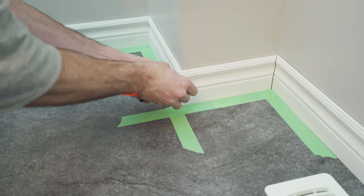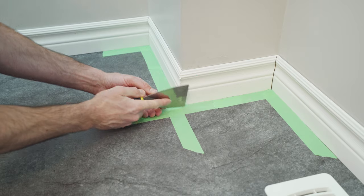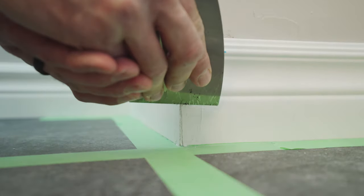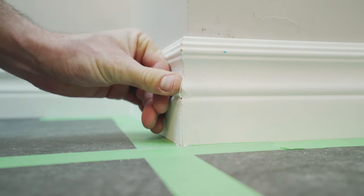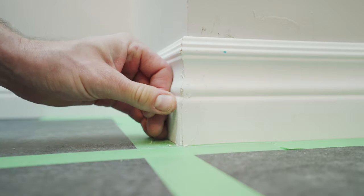As you apply the wood filler, always start at the bottom and work your way to the top. Use a small putty knife of about two to four inches to work in the wood filler. Do your best to get the wood filler all the way to the back of the joint to ensure it is fully filled. For trim like we have here, it is easiest to use your finger to work it into the corners rather than the putty knife.